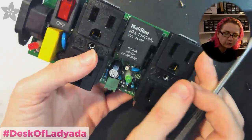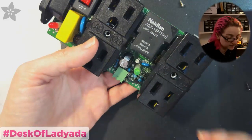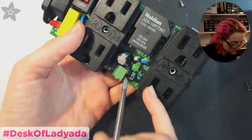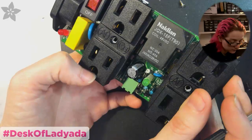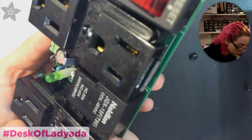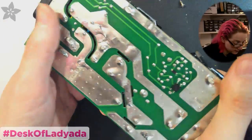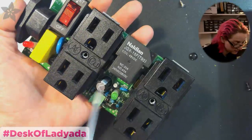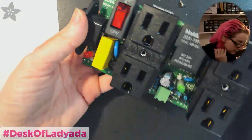I think the first version of the power switch tail was direct connect, and you had to have a transistor driver, and you had to have a flyback diode. With this, that's not necessary. That's all done for you. Someone wrote the words opto feedback. I don't know. Maybe I'll look up what opto feedback is. But yeah, and then this LED lights up when this is activated. So I like this. There's a lot of really good signs here.